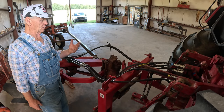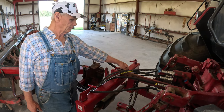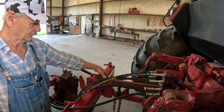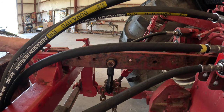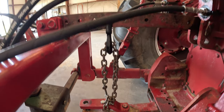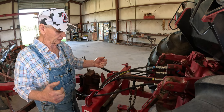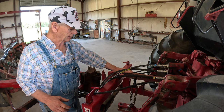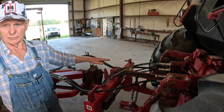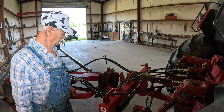Well, anyway, when I put this on here, I knew it was gonna go up, so I had to do something. So we did this last Friday night, I think. Made this out of a 1x3 flat bar out of the rail on the plows we had left over to salvage stuff. So we drilled the holes in here and there, and I put this on here in that chain, and I've got it marked up there at the cab how high I can pick up, you know, I don't want the pressure on the cylinders all the time or the cylinder breaking out or anything. So I knew how I can come up. When it just gets tight, that's all I need. And then pick this up right here, then the plow picks up level. And going down, I go down like all I want to on this thing.